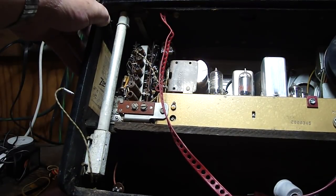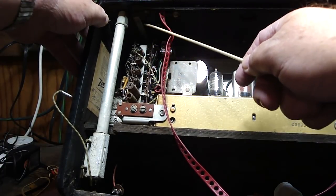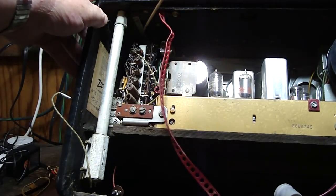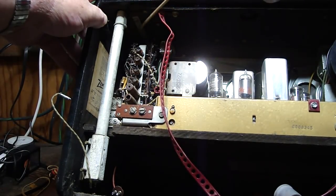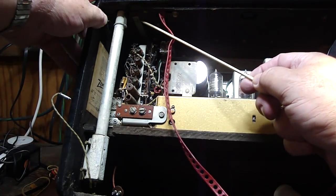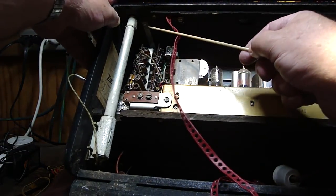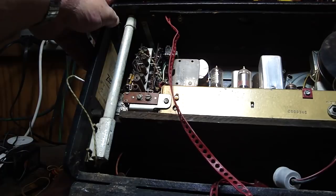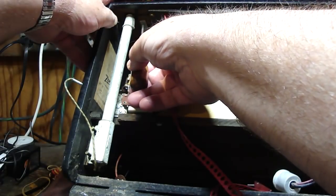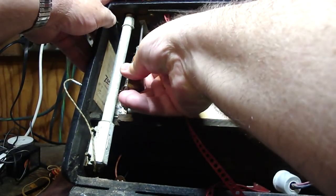Now you can see here we have our band switch assembly here, but if you look up top, there's an arm or a piece that comes up, and this is what's holding the band switch assembly all together here in the center. But there's actually a Phillips screw right at the end where I've got this little pointer. I know the light isn't too good in there. Maybe you can see a little bit better now. Okay, well, that actually holds the band switch in place to the chassis, so it doesn't move around when you hit the buttons. So you got to take a Phillips screwdriver.